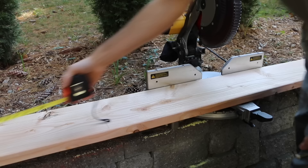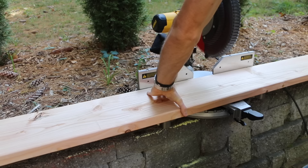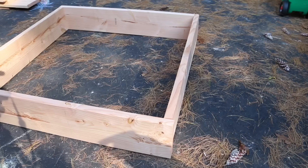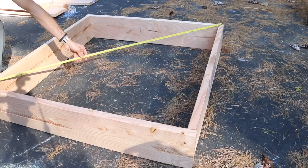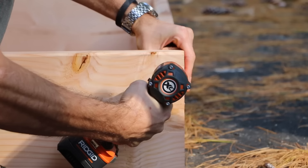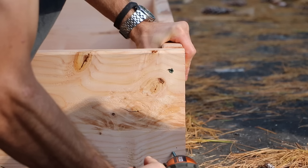In this example, I'm going to make a 4x4 box. So I'll first measure out 4-foot-long boards and cut them with a saw. I'll then lay them out on a flat surface and make sure that the angles are square. I'll also measure each opposite corner to make sure that the measurements are the same, ensuring that the box is exactly square. I'll then tack them in with screws.